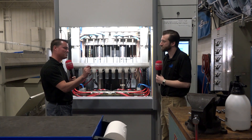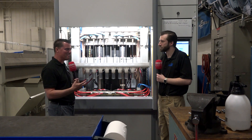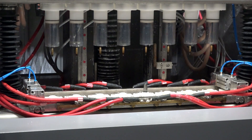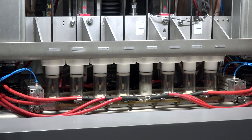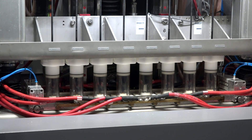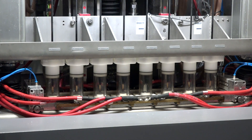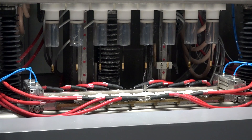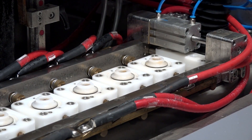So now that you mentioned an end mill, and we talked about the gun barrels — in my head the first thing I think about is broaching of some sort. But with a machine like this we don't really have to worry about tool life. Are we saving money on tools as well? Yes, that's one of the main benefits of ECM. ECM tools last a very long time because they actually don't touch the workpiece in many applications. For example, in turbine manufacturing we're doing a surface profile operation — we come in with cathodes from the side and sink that complex form right into a solid block of metal, turning that coupon into an airfoil. The cathode never actually touches the workpiece. There's a very small gap, just a couple thousandths of an inch.